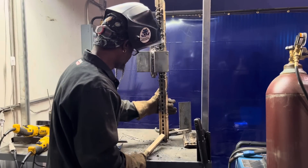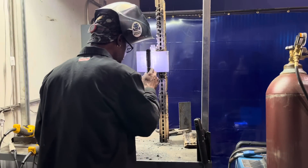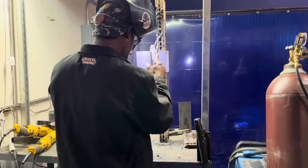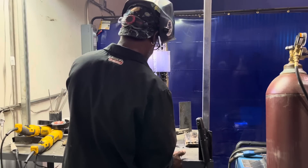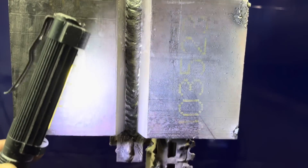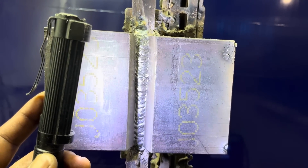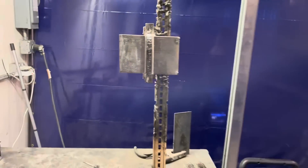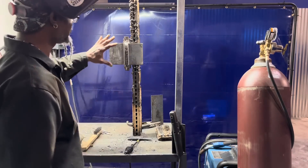He had started, so I came back in here and finished it — I fixed it. Now all he's doing is running. I can see one little piece of slag at the top, but that little piece is actually going to be in the zone that won't be tested. So looking at this root and the hot pass on top of the root — that actually did it. Now all you really want to focus on is your stringer beads. Run stringer beads right to left, start bringing them over — that's how you do this test. That's the easiest way.